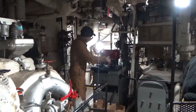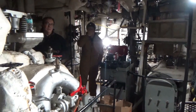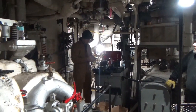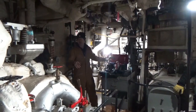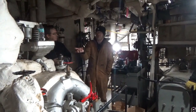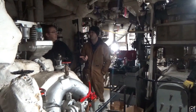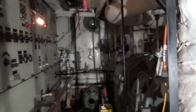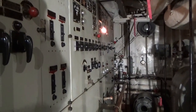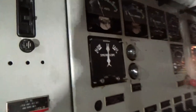Is this on at near full power? This is running full 450 volts to the board right now. Last time we tied it to shore, that was much lower voltage — that was very much initial testing. Now we're at full 450 coming off the pier. The fuses haven't popped, which means we haven't exceeded 20 amps, which means the board is carrying power and we're not seeing any sort of damage. Unfortunately, all the meters were damaged in the flooding event — we have the face plates, but the meters themselves are pretty much cooked due to oil, salt, and water corrosion.